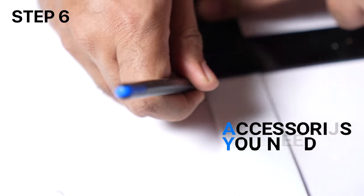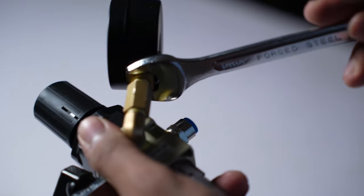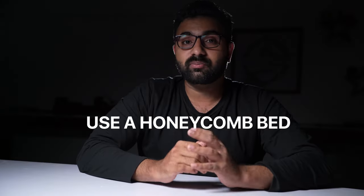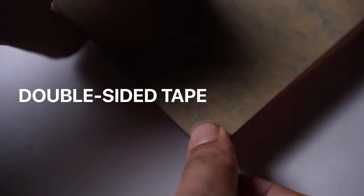Now about the accessories you need. If you have an air assist, use it — 20 psi is enough most of the time, but 30 psi is recommended if possible. Anything above 30 psi will only have a marginal difference, so it's not worth it. Use an exhaust system if you have one, as laser cutting acrylic produces a lot of fumes. I would recommend using a honeycomb bed for work holding, but if you don't have one, you can raise your sheets on some wood blocks. It's also a good idea to use double-sided tape to hold large sheets. The heat produced while cutting can bend sheets and affect your cut, and the air assist can blow cut pieces onto the laser path and ruin your piece — so keep an eye out for that.